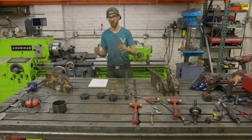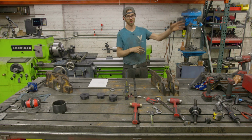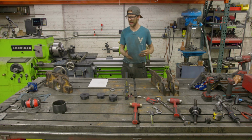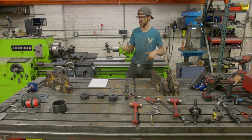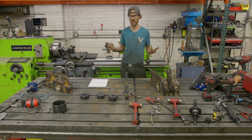The most ideal way for me to do it, without doing a portable line boring machine, would be to use the horizontal boring mill. I think the feed rate on that is going to be a lot more gentle, and we can do it on its side, which mitigates some other issues as well. So I think in the future, maybe we'll be leaning towards that if we're in the shop. And if we're in the field, obviously we'll be doing a WS2.